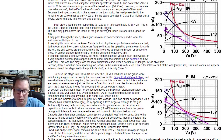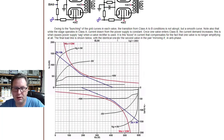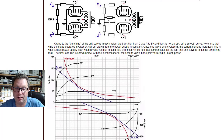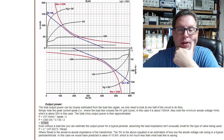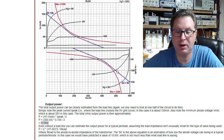But anyway, if you have an opportunity to read this page, go out here and find it. It is there. And they're actually using the EL84 here as their example. They plotted load lines, they picked grid resistance, the whole grid voltage, everything. They walk you through, and you can see here they're talking about two different sides of an amplifier, so you have to figure out the plate current for both of those. But anyway, if you get down to the very bottom here, you see this plot, which I'm not going to get into, be a class all in of itself, probably a 3-week long class.